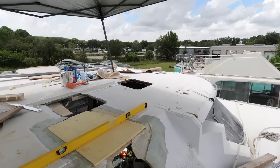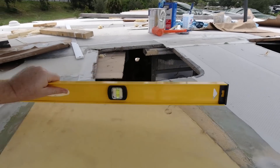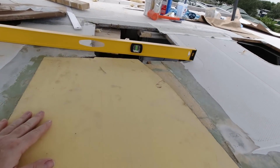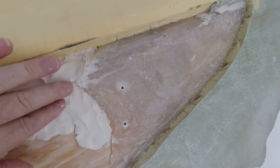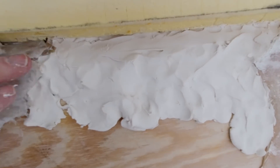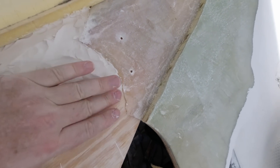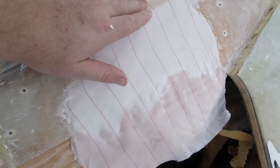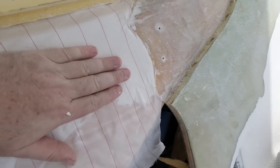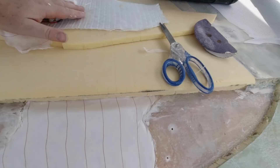This core, because I built it up out of two pieces, is an eighth of an inch too thick — and I knew that. So I'm just going to come and grind this core down, get it level, and we're going to make it work. It's arts and crafts time. I'm going to spread the clay out so that I get a level mold for putting on the next layer of glass so that it's even with the core. Here it is with the peel ply on it — the clay with the peel ply. Not exactly a work of art, but it should do what I need. Let's get the first layer of glass on here and then get the core in.